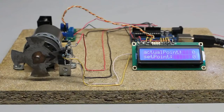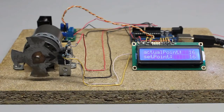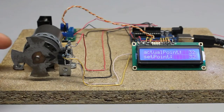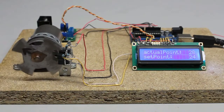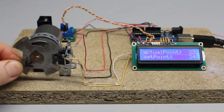If 16 steps are transmitted with a single command, the motor does a full turn without a brake. Commanding 8 steps causes a smooth 180-degree rotation. If the motor is stopped by hand, the motor is kept energized. Not until the motor is released and all 8 steps are processed does the Arduino turn the motor off. If I turn the motor some more degrees by hand, the microcontroller detects that the motor was spinning too far. With the H-bridge, the motor is controlled to spin in the opposite direction until the sensor disc reaches the specified position.